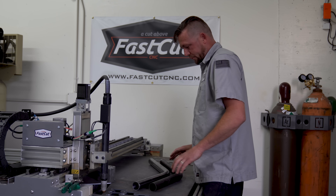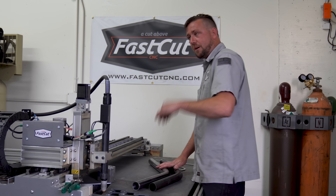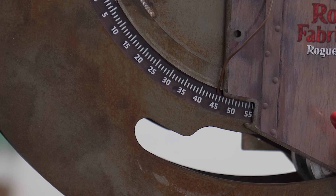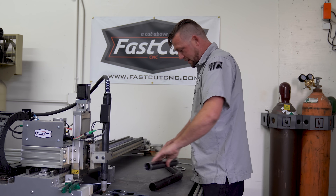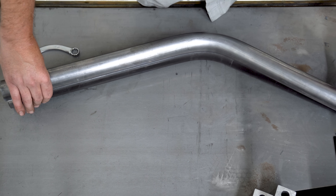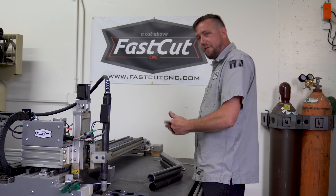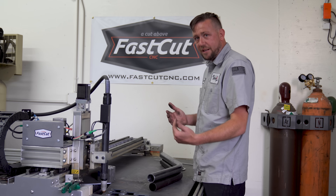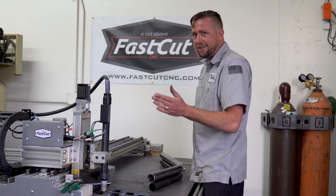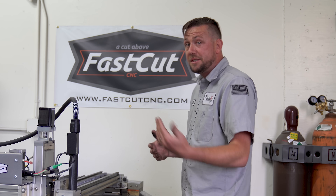I brought these over to a table here so it's nice, flat, and even — you can actually see it. Remember, we had the target angle where we bent to on the Rogue — it was exactly 45 degrees, or as exact as we can get it with an analog dial — and both of them landed at 45 degrees. If I take the ERW and stick it on top of the chromoly and actually line them up, we can see that the ERW bent more than the chromoly. Even though we hit them both at 45 degrees, the chromoly — having a higher yield strength and higher percentage of elasticity — bounced back, or sprung back. It popped itself back towards straight, wanting to flatten back out automatically to a different degree.